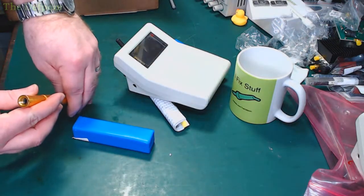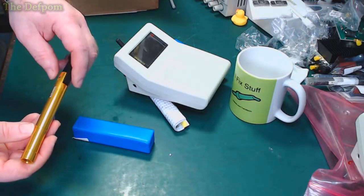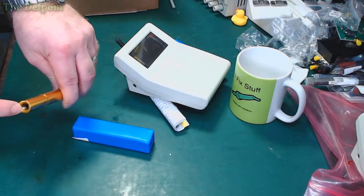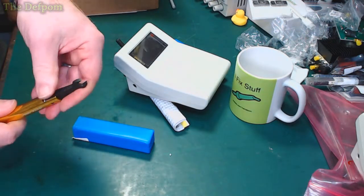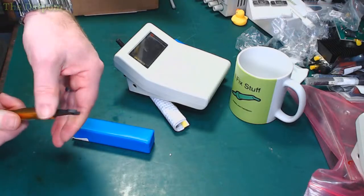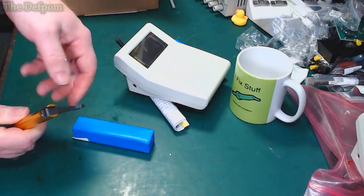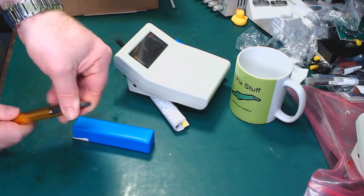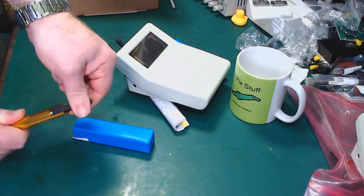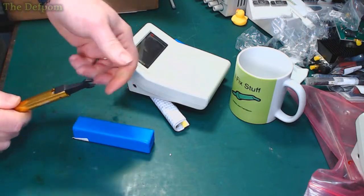And it's got an adjustment in there. I've got no idea what the adjustment range is. It was mentioned in the listing. But there's like an Allen key in here. You just do that up to increase the spring tension. So it's sort of like a toggle thing which pops over. It'll go either way. This has got a detent here. This has got basically a ball bearing inside here, which pops into the detent. So that force of popping that spring out is what acts as a torque.